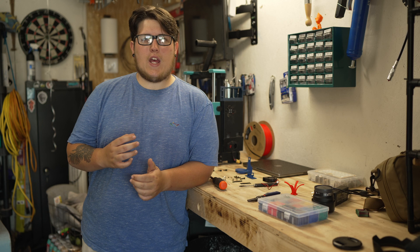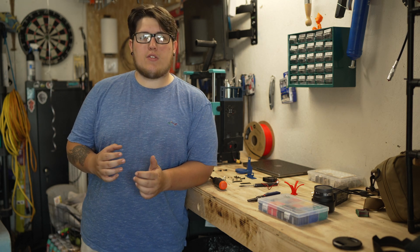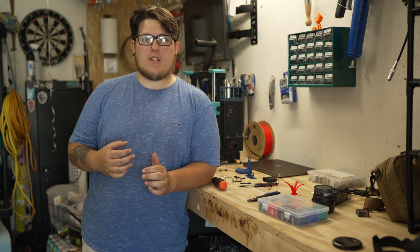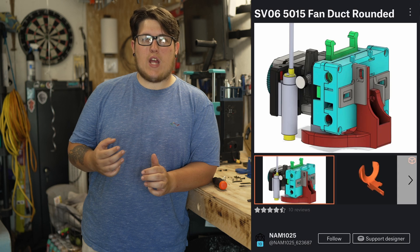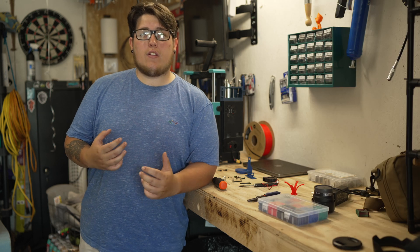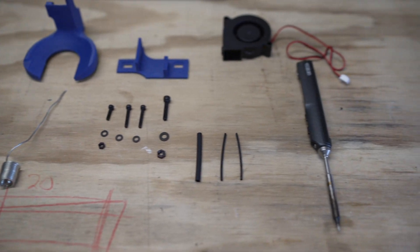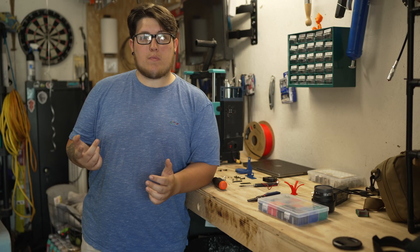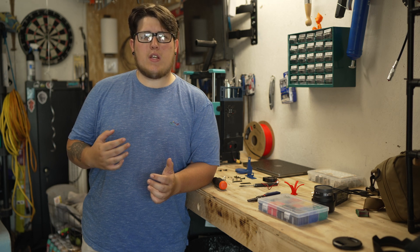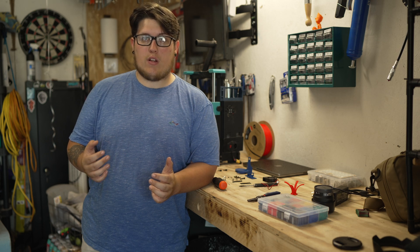The SV06 uses an underpowered print fan for today's times, and it's going to be pretty easy to get it upgraded. The parts that we'll be using are actually designed by somebody named NAMM1015 or 1025 on Printables — I'll have it linked in the description below. There are a few things that we're going to need: Allen keys for the size bolts you need, wire strippers if you have to solder like I do, and the printed parts out of something higher temperature like PETG or ASA, because you're not going to be able to use PLA near the hot end.